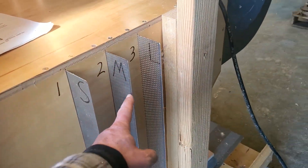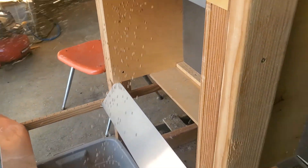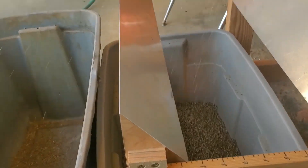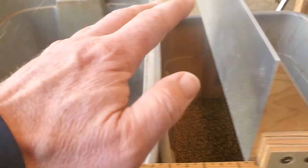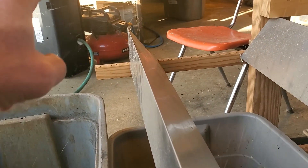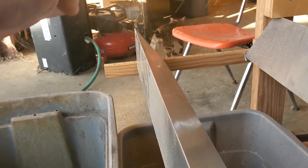You use a series of screens to modulate how much airflow pressure you're getting. You can slide this back and forth to make sure you're capturing the good stuff and not letting waste go into the clean bin. The stuff you don't care about ends up back here, but there's a little bin to check so if you're making a mistake you can recuperate things. I can really see the column and where the good seed is falling versus where the waste product is going.